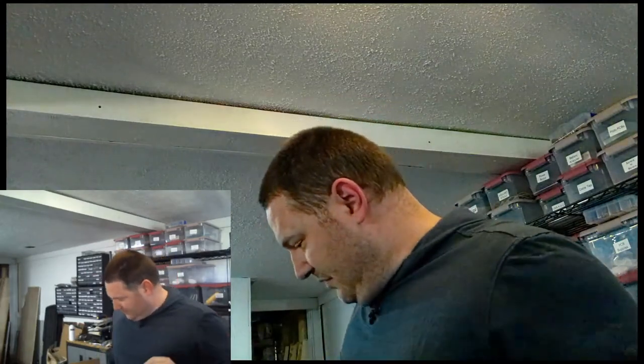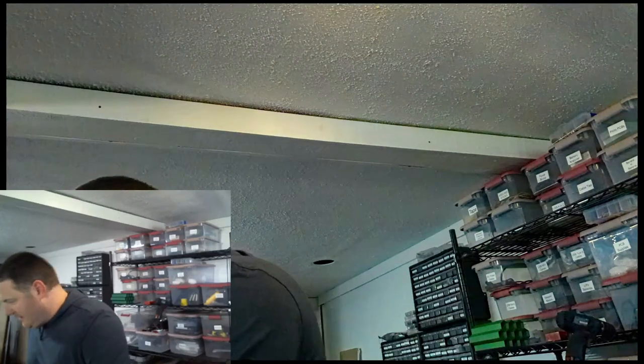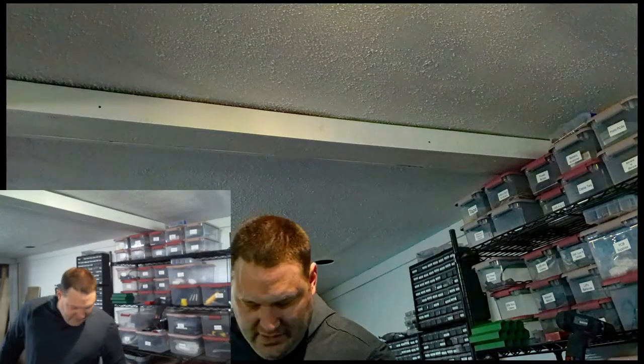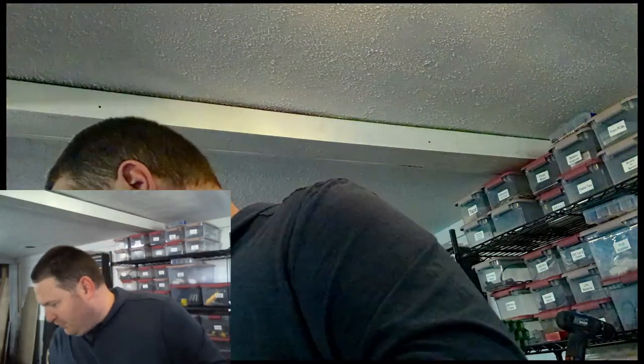Now, it's not loud enough for you guys to hear, but I want you to hear it. So what I've done is I tried to build a couple of LM386 audio amplifiers. Problem was, they didn't work. They were oscillating rather than amplifying. It was just a pain in the ass. I ended up grabbing a pre-made LM386, which is fine. A 386 is a 386, as long as they're real, I guess. And I've got an amplifier here somewhere in the desk, once I unbury it from all the garbage, that is going to allow you to hear what I hear.